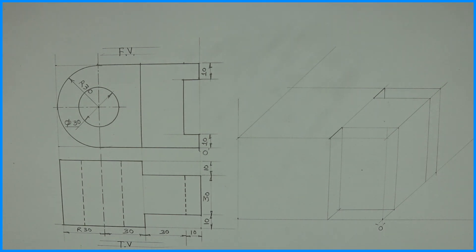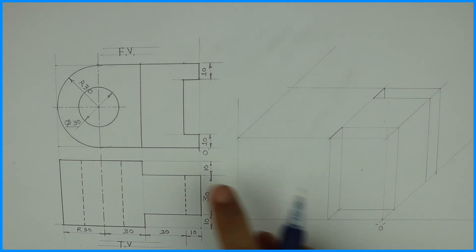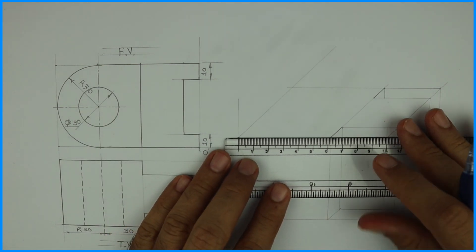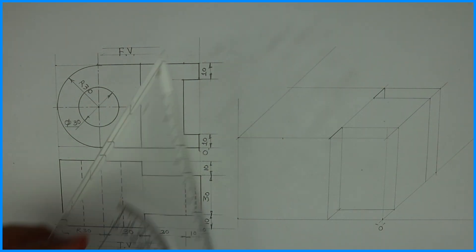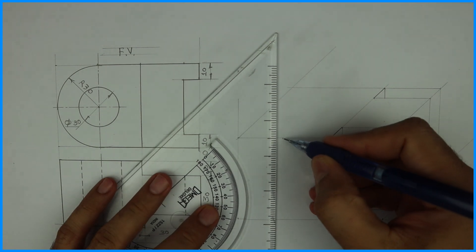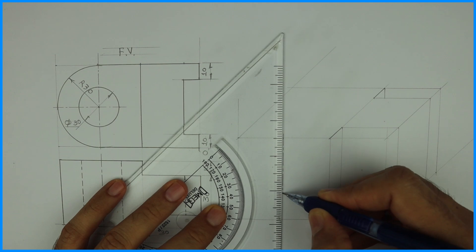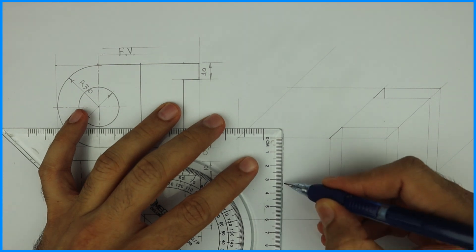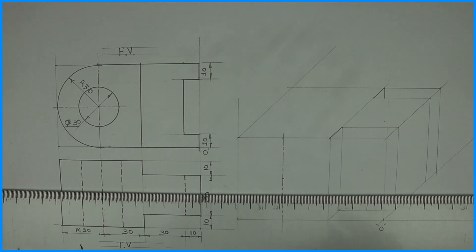Always go for this box first, and then go for the circle. Now in the front view, you'll have a circle. We'll take 30 from both sides — 30 from here and 30 from the vertical line. I'll draw the axis. And how much should I go down? 30. That is the center point, and from that point you draw the circle.